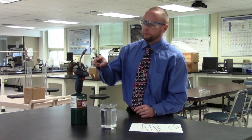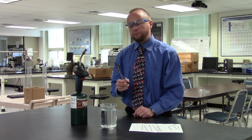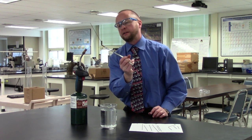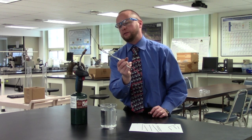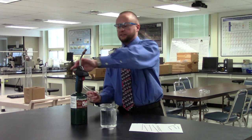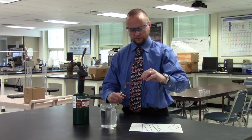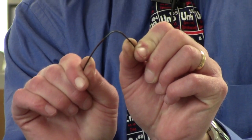First I'm going to heat it again, get it glowing red, and now quench it. Of course we know if I try to bend this right now it's going to snap like a twig. But now I'm going to reheat it — I have to be careful because there's a certain temperature range I want to stay in, so I'm not going to get it glowing red, just give it enough heat. What I'm doing is allowing those molecules to relax and go to an equilibrium position. I'll let this cool for a second and show you that we've gone away from that brittle behavior — and now I can bend it.